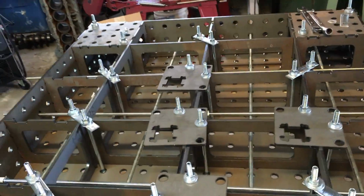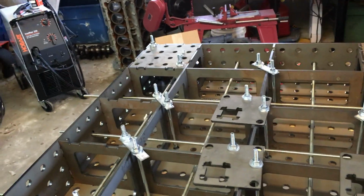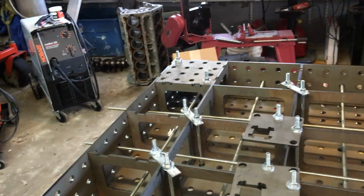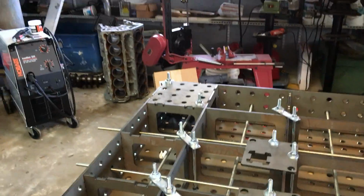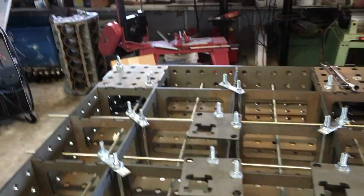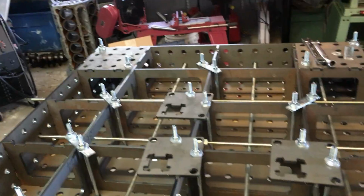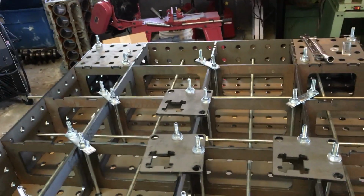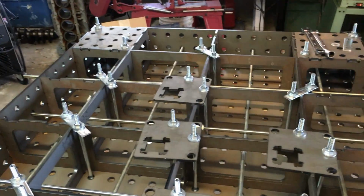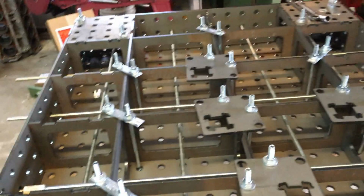Just for some messing around, I have a little gear wrench over here, just a regular 9/16 gear wrench, and I've tightened up the center one here and backed it off. Basically, you can tighten it to where you can hold the bolt with one hand and tighten it with the other, and that's probably all the torque you're going to need. You shouldn't need to put a wrench on the bottom to draw these up, unless, of course, the threads were a little boogered up, as on a couple of these, so I had to use something to hold it so I could thread them all the way on. But for the most part, you shouldn't be putting a ton of torque on here, and this cheap strapping material I have here isn't going to take a lot of torque.